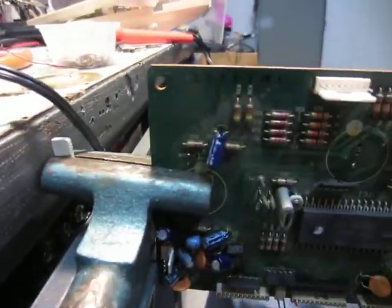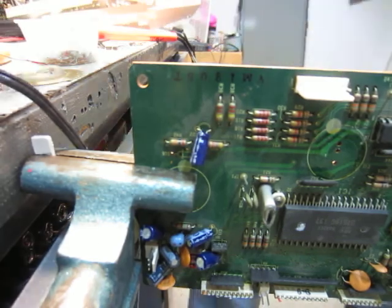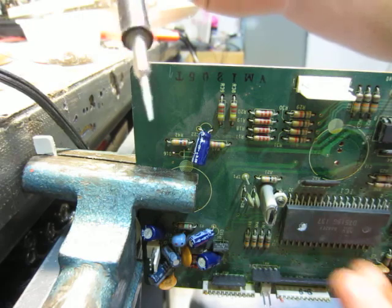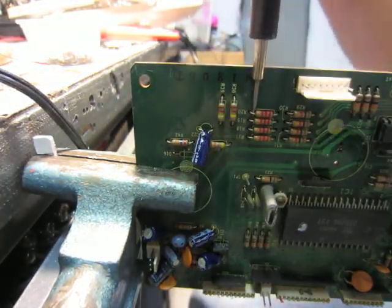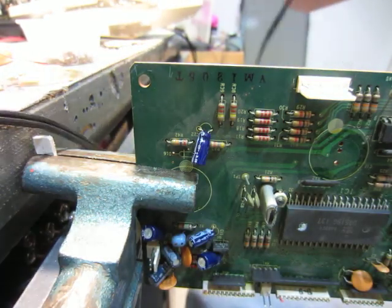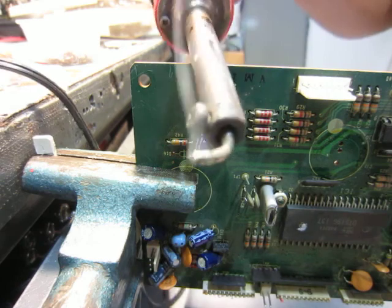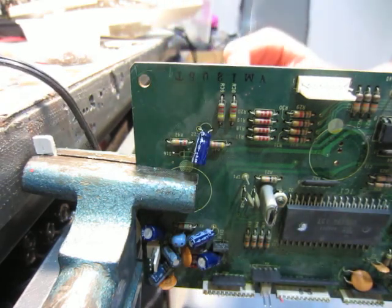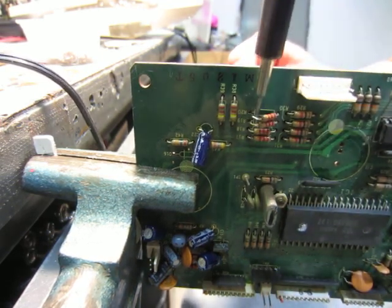Let me put the camera on the tripod here. So basically what I do is I've got this — it's just a probe for a voltmeter and it's a really sharp point. What I do is I stick that behind one side. And then I take my soldering iron — I bent the tip over so that it can get in small places — so I heat it up on one side and then stick this and just pry it off on one side.